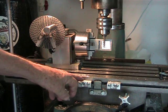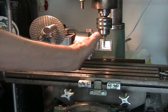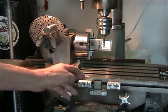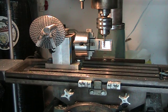The milling table has two stops on the x-axis so that limits the transverse movement to the two extremes. I also have a depth stop on the quill so the end mill will only go down so far and then stop. Once I get that to the bottom, that will stay there — I won't be raising and lowering that.